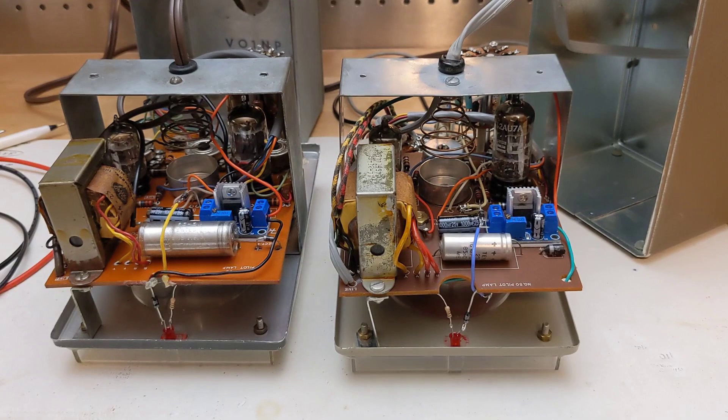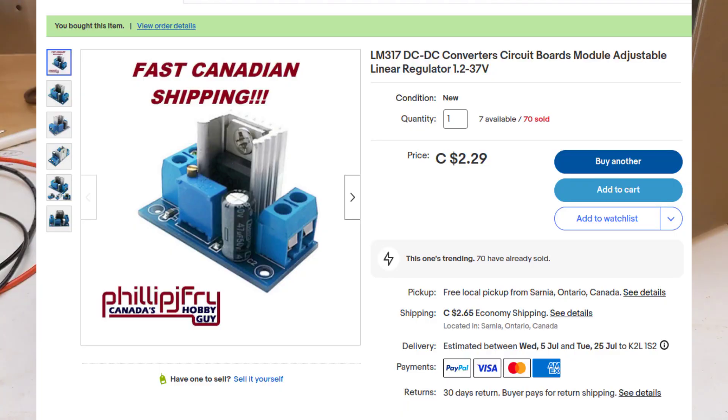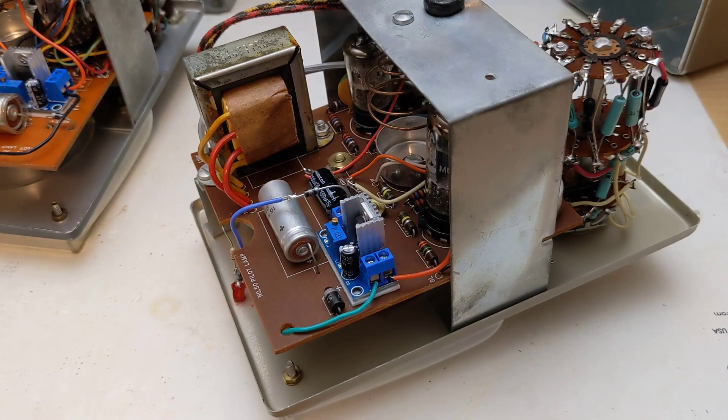For my two Heathkit VTVMs, I tried a variation of the LM317 regulator approach. I ordered a low-cost DC-to-DC regulator module which uses an LM317 regulator IC and provides a trim pot to adjust the output voltage. An external diode and 1,000 microfarad capacitor are added to rectify and filter the 6.3 volt AC filament voltage. Note that you can't use a full-wave rectifier in circuits like most Heathkits, where one side of the battery and filament transformer is grounded — you have to use a half-wave circuit with one diode. I bought two of these modules from a seller here in Canada; the modules were about $2.50 each plus shipping. I mounted the modules using double-sided tape to an open space on the PCB. The diode and capacitor connect to the module, and it's wired to the 6.3 volts AC from the pilot lamp and the battery positive connection of the range switch.